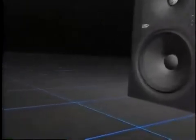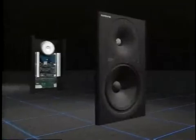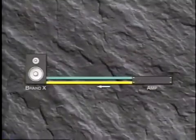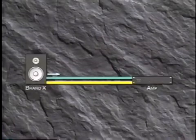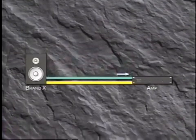However, our low-frequency transducer is directly coupled in a servo loop with its 150-watt amplifier. The transducer's added DC resistance is canceled by the negative output impedance of our amplifier. After individual trimming, the combination creates an exceptionally strong braking system that produces tight, articulate, individually delineated bass notes. Compare that to a passive monitor at the end of a long speaker cable, a situation where instantaneous low-frequency transducer braking is difficult, if not impossible.